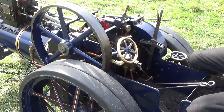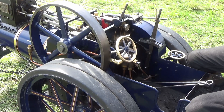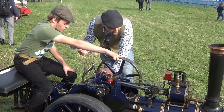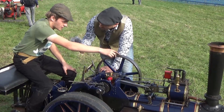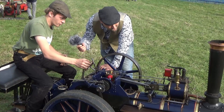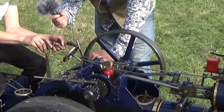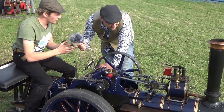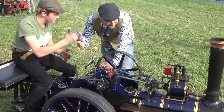On this engine, the reversing lever makes the engine turn in the opposite direction. You've got what's called a slide valve on this side of the cylinder, and when you put the reversing lever backwards it lifts up this contraption you can see here. That means the slide valve moves in a different way to allow the pistons to move backwards.